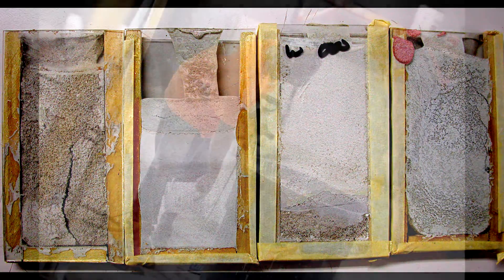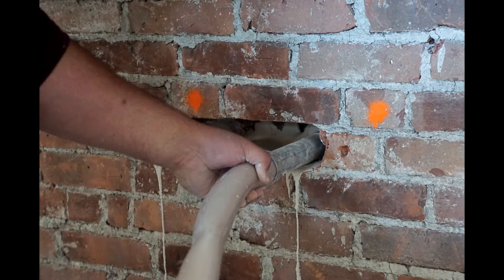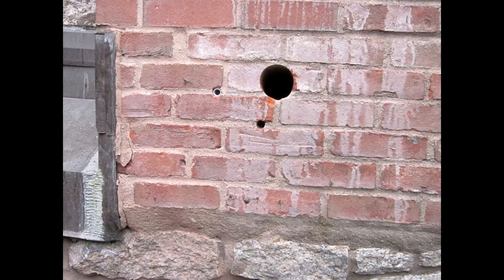Our careful, quality-controlled blending of lime and Pozzolan in just the right proportion allows for complete reaction of the lime without the residuals that can bleed out of the masonry and cause streaking in non-hydraulic lime applications.